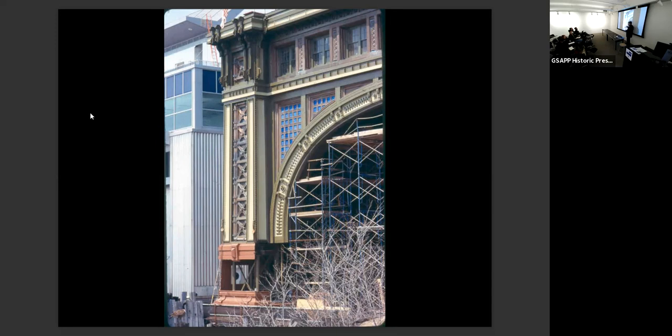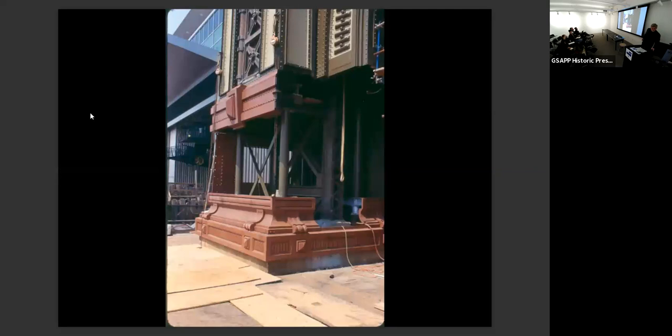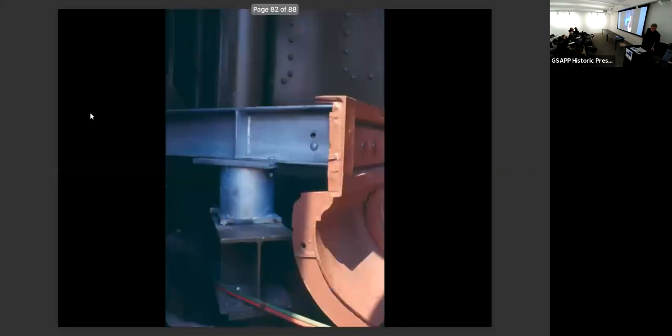And everything was down here, weight bearing, it bore its own weight, right? But so we could do that at the very end. In fact, we had so much work to get done at the top, and we had a new structure to support it, that we didn't need those pieces on the bottom. So it wasn't as if we were building from the bottom up. We were building from the top down to a point where we could put the pieces on and they would not be endangered by the weight of the pieces above it. There's the new structure. And that structure didn't exist, and that's the reason all that cast iron cracked at the bottom and fell into the river.